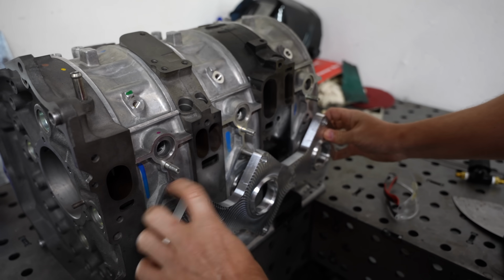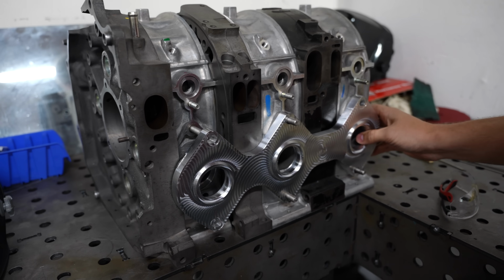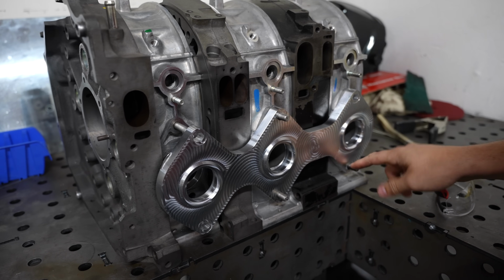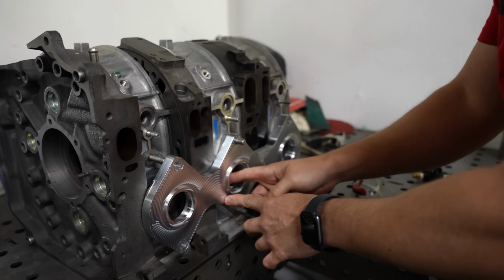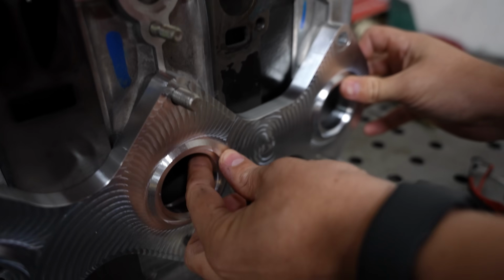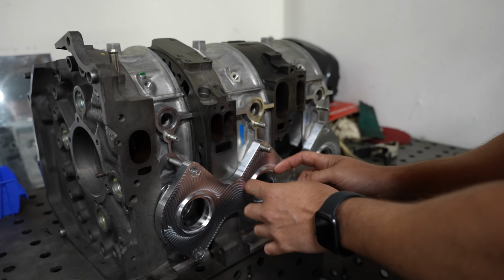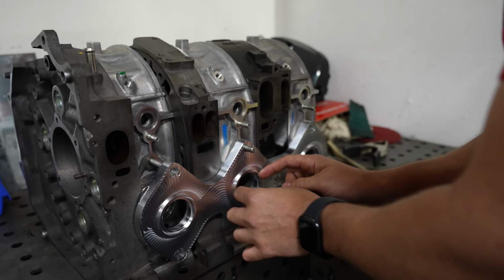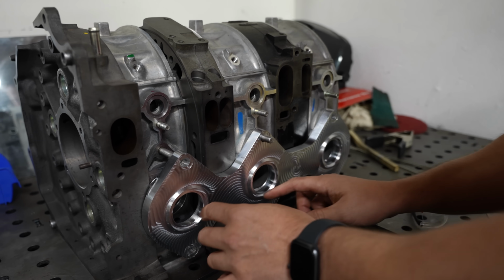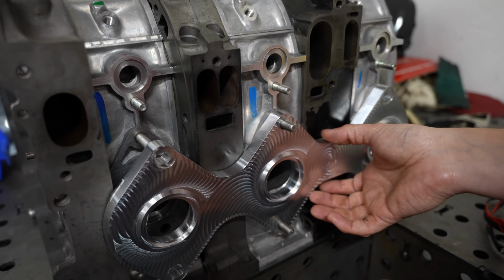Only reason why is that I cut them on one side, not the center. If they weren't slotted, that thing would be on there. Oh, look at that, one worked. Yeah, you can see it working. And that nice taper on the inside goes right to the shape of the inside of this tube. Fits perfectly. This is a 1/2 inch thick, plus the 5/8. We actually go out of our way to make it thicker just for these lips, so you can weld them on and make a really nice clean transition there. So that's the whole reason we made this custom piece.